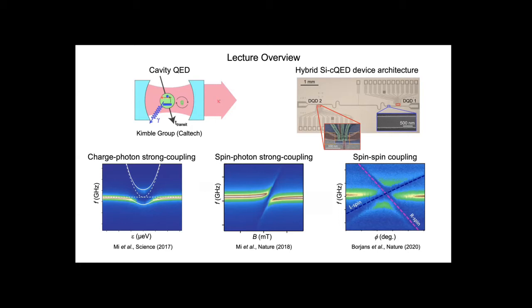Let me give a brief overview of the cavity QED physics relevant for our system. I'll cover the device physics of how our structures work and show how we can embed our semiconductor spin qubit devices in a microwave cavity with a moderate quality factor—at least high enough to see strong coupling physics. The first demonstration I'll show is that we can take a single electron, localize it in this device, and coherently couple the charge degree of freedom to a single microwave frequency photon.